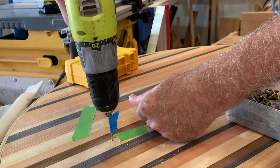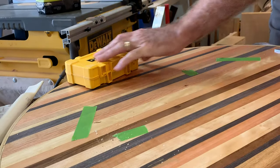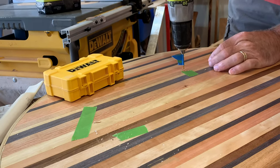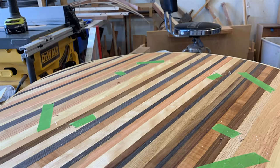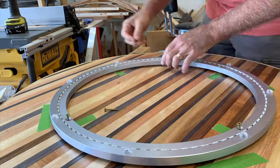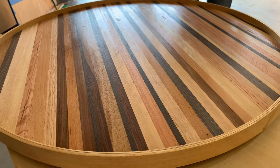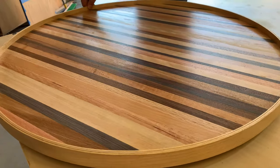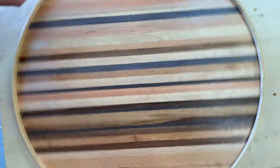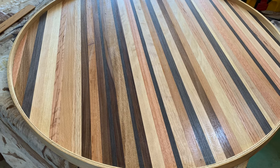To mount the Lazy Susan turntable on the bottom, I pre-drilled some pilot holes about a half inch down — that's my mark on the drill to make sure I don't go through the bottom. There are four holes for mounting the Lazy Susan. I put my Lazy Susan centered over my holes, get my screws, and screw them into the board. Now we've got the turntable installed — this is what it looks like, and this is how it turns. Nice and smooth. That makes for our completed build. If you liked our Lazy Susan charcuterie board, give us a thumbs up, consider subscribing, and come back and see us real soon.